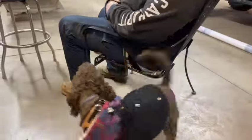All right, guys, I'm out here in the shop. This is the building paper that we're gonna put in the footer. So I was just gonna cut it. I marked it off. These are 9 foot rolls. I marked it off at 3, 6, and 9. So we'll have a 3 foot piece. I'm gonna just cut it with the chop saw here.